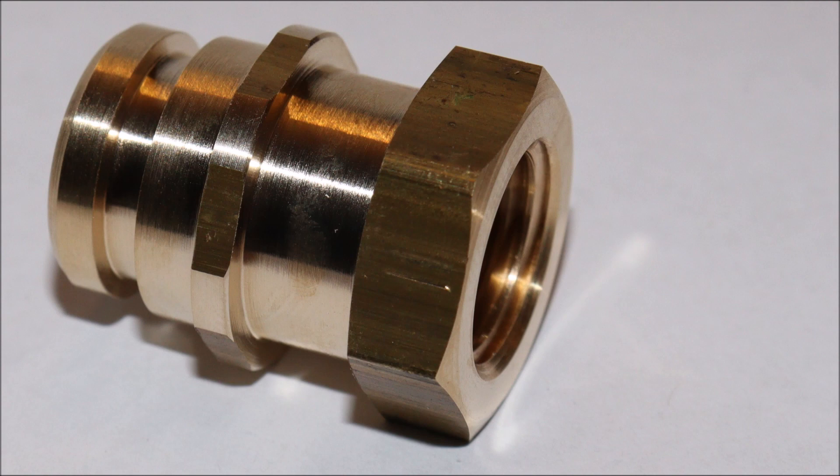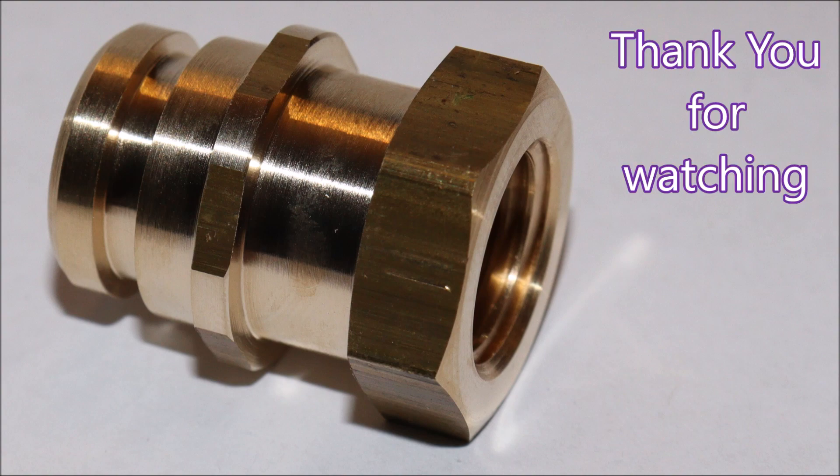So now I've gone back to finishing all diameters with the parting tool. I'll know that I can virtually measure any diameter and know that the rest of them are correct. Thank you for watching.